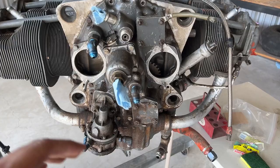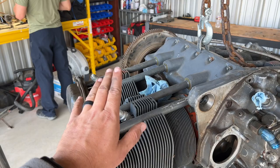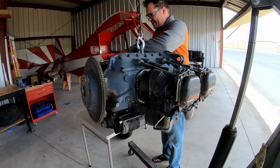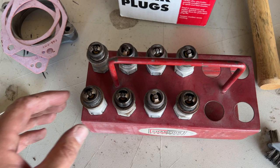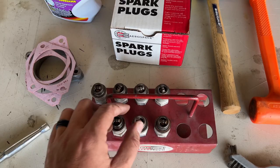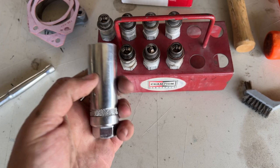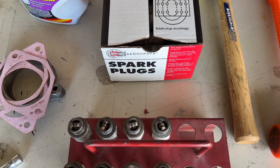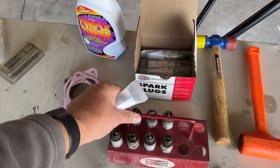These turned out great — nice and clean surfaces to be able to work with. Dwayne's still over there fiddling with things. I'm going to take the spark plugs out because part of doing this job is making sure that the engine is at top dead center, and it's much easier to turn the crank when the spark plugs are out and there's no compression. I got all of these guys out and thankfully I only dropped one of them. But the good news is we do have a whole new set of spark plugs. I'm using this Champion Aerospace spark plug holder — this Champion Aerospace spark plug puller. It's got a magnet in there. This is fantastic. And Champion went ahead and joined us in this mayhem for the Red Rocket and sent us a whole new set of spark plugs for this airplane.